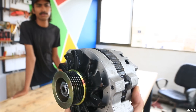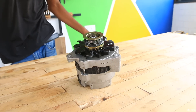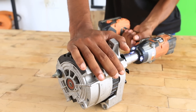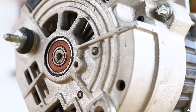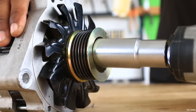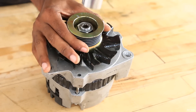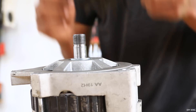For this conversion we are going to use a 12-volt car alternator. These alternators convert the mechanical energy of an internal combustion engine to top up the battery as it powers the onboard 12-volt accessories. The fact that they are attached to a fuel-burning engine makes the design of these alternators justified — inefficient yet robust. Most of these alternators have thick stator laminations like this one, resulting in excessive eddy currents induced into the stator, causing lower efficiency.